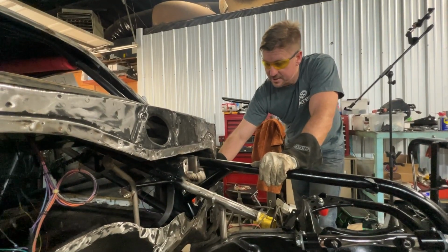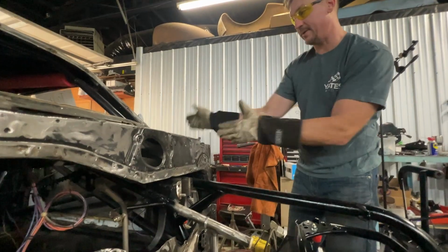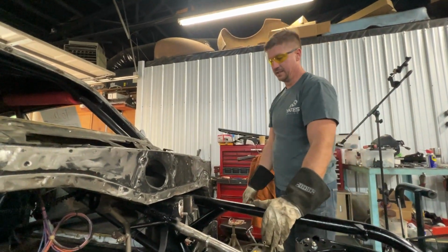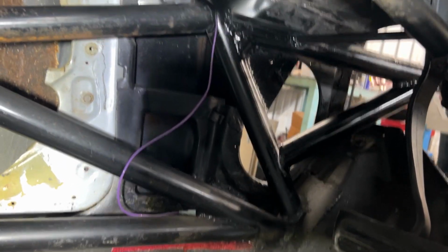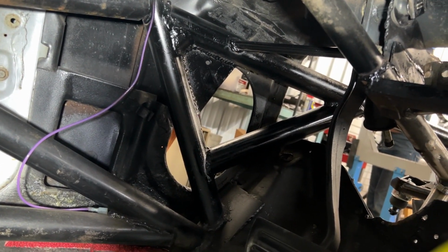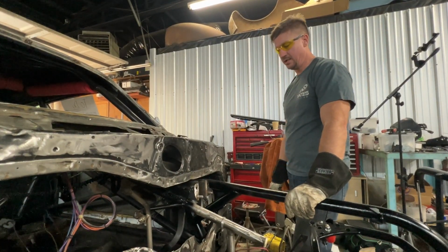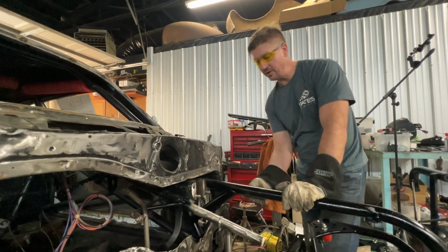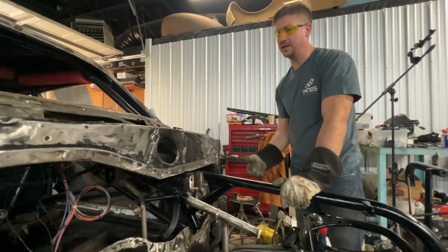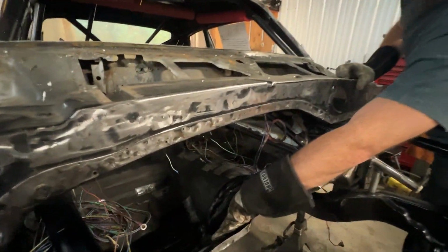We did two gussets on this one. This was the worst bar, and it was the biggest concern because it's right beside the driver's left leg. So we put what's called a taco gusset in there. There's some better pictures that we'll post on that. And a triangulated gusset on top of that. So now we're feeling good. We might even go back and make another bar here if we have time, but we are running out of time. In the floor, we have a new floor patch.